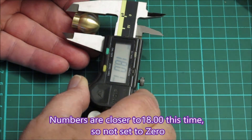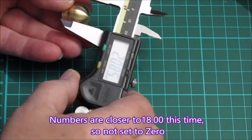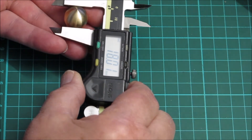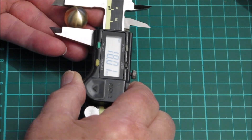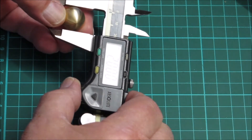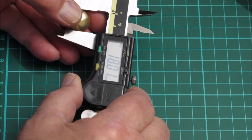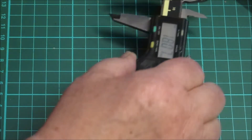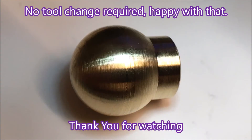This was very close to dead-on size, so the caliper wasn't zeroed. Measuring across the diameter, it was pretty much the same in both directions — that was using 9.2mm. So basically, for an external radius you take the radius and add the radius of your tool. The parts are done and the program's good to go, so it can be sent off to the UK with no problems.